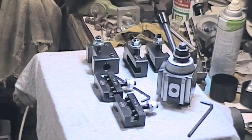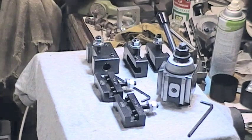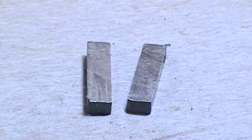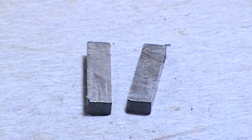This is the conclusion of the quest for another tool post — in fact in this case a better tool post. Really all that was involved was making the T-nut and we're good to go. Better than all the work that would have been involved to make my four-way tool post clone — I may yet do it but it's not going to be on the urgent list. Two pieces of off-cut from the original T-nut from the hand hacksaw job — I'm keeping them as souvenirs. Incidentally, I could have made up a completely new T-nut from other stock, but the stud or draw rod is 18mm by 1.5mm and it's just not a tap size I have, so that's why I decided to machine the one that came with the tool post.